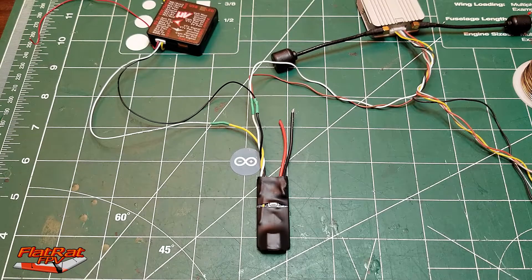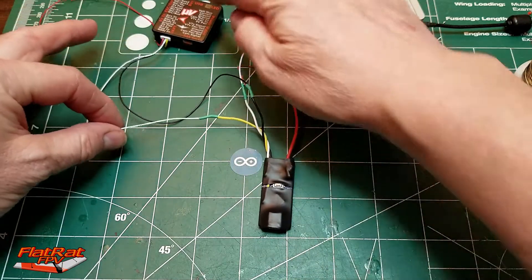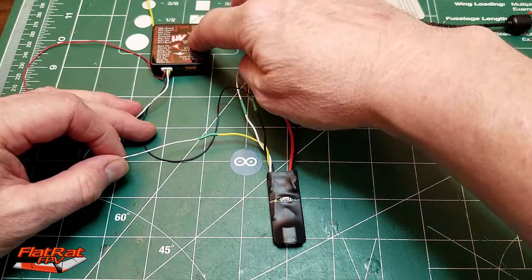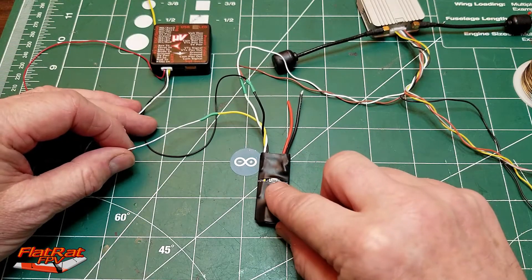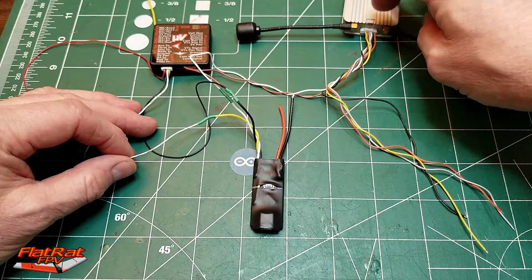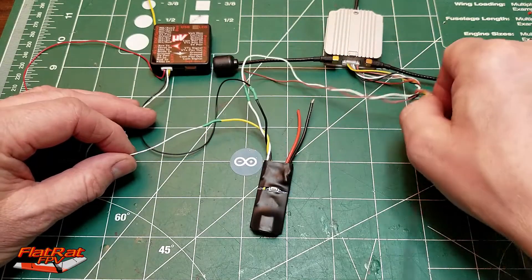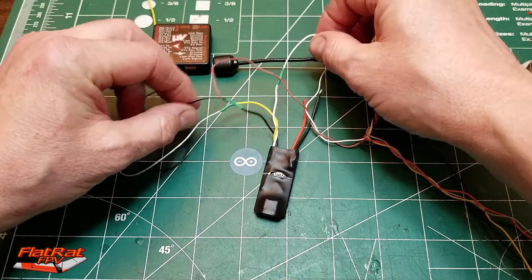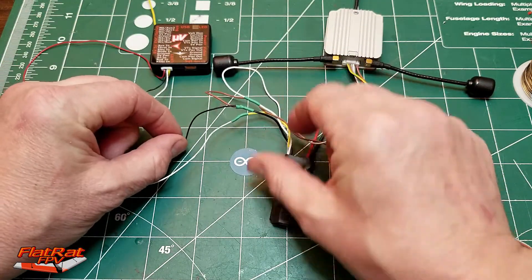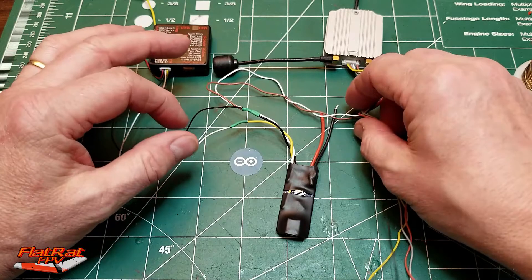That's all the connections you need to wire it up. You're going from the transmit on your micro vector — or regular vector, whichever — to the yellow wire of this unit, which goes to our Arduino. It gets processed and spit back out, transmitting through here and going into the receive on our air unit, which is the white wire. So it's white to white on one side, yellow to white on the other side, and the brownish wire providing the common ground between your air unit and your vector.